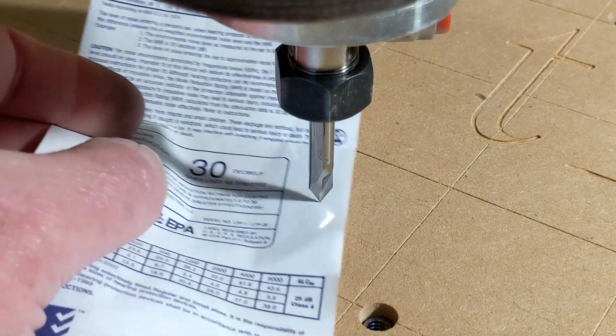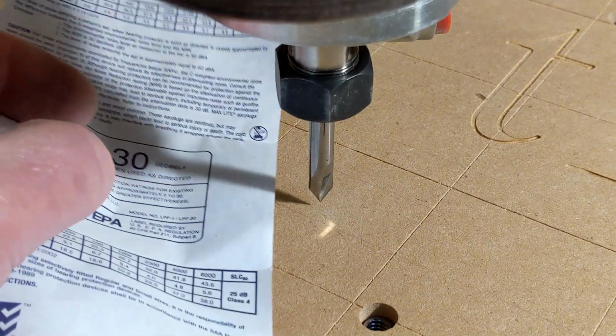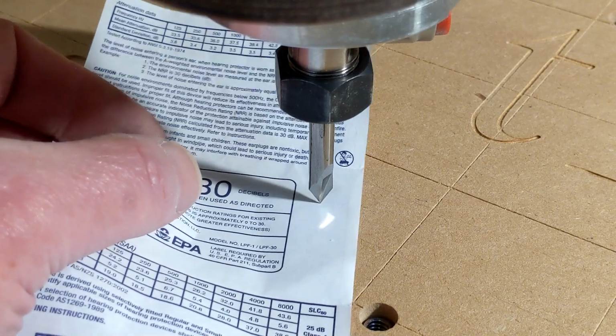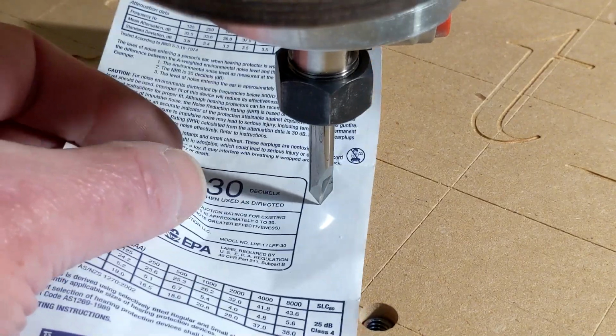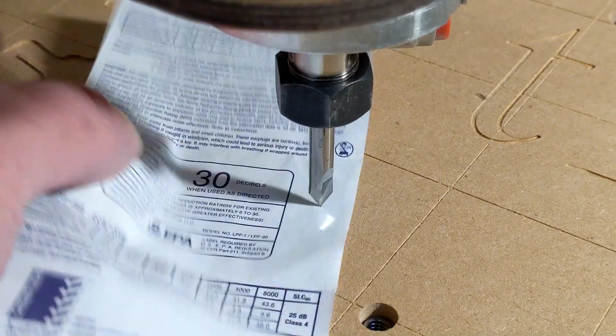And I take advantage of the shadow, so I know. If you get a little concerned that maybe you're getting too close, then you can stop a little earlier. And then what I'll do is I'll just tap it. Now remember, I got the Z set at 0.005, so it's going to make very small incremental moves. And I'm moving the paper around, and there it is.